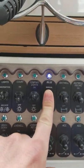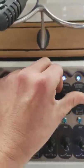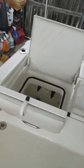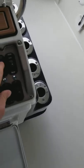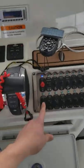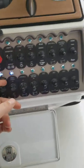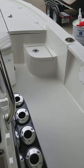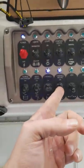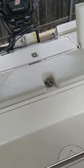Your bilge is an automatic bilge — this is how we turn it on manually if we need it to run. This is your bait well fill and your recirc, which is this live well here. This is your horn — it's extremely loud. Then we've got our wash down and our fish macerator. Your wash down pump is up front in that compartment. We've got our live well and live well recirc — that is your center box, your main live well.